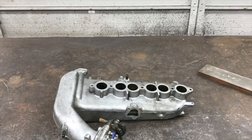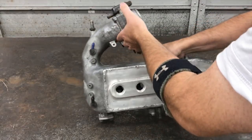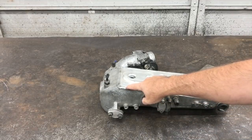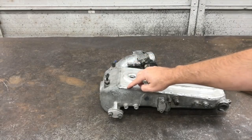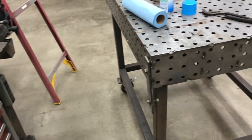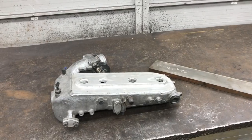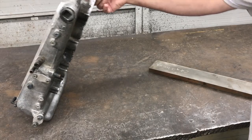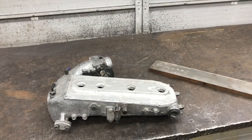What I'm going to do is grind the weld off and take a closer look at the crack. I'm probably going to work down this way a little bit — I don't think it comes down in here but just to make sure I'm going to grind down and re-weld all the way around. I'm going to do a preheat on it, and then once we're done we're going to go over to the table saw — which is a cast iron flat surface, should be relatively flat — and lap the flange in with spray adhesive and sandpaper. That should take care of it.